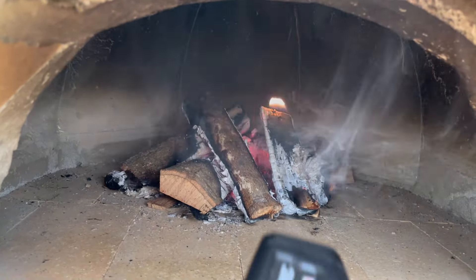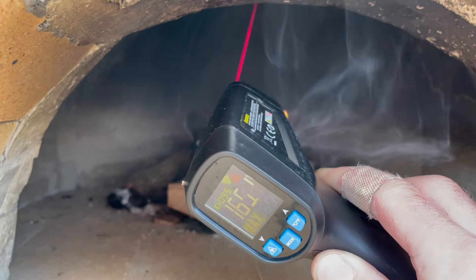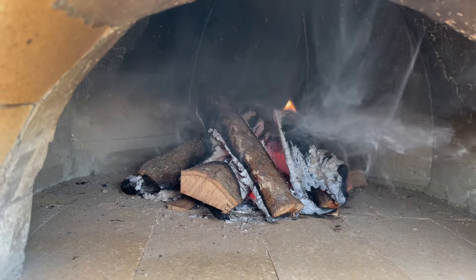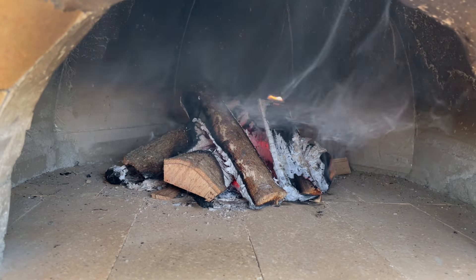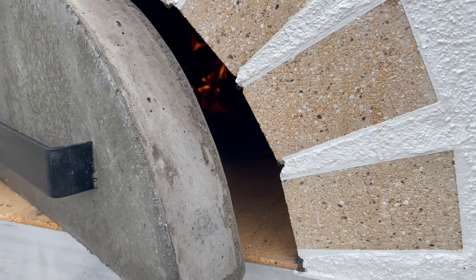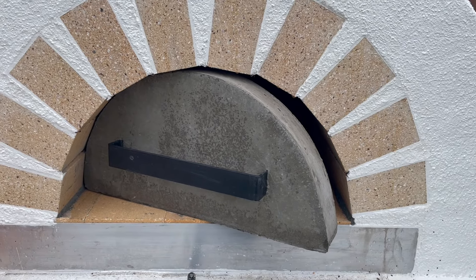After the second stoke-up, we are rocking at 153 degrees — absolutely perfect for our first firing. Remember, I'm only measuring the surface of the inner dome, so it takes a while for that temperature to dissipate through the full thickness of the mortar. That's why we keep a really small fire and bring everything up gradually. 150 degrees is right on target. I also recommend using your door — it helps contain heat, especially if it's a bit windy — but don't close it off completely; you still want good airflow inside.